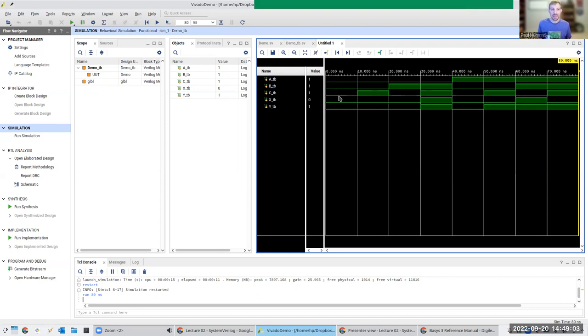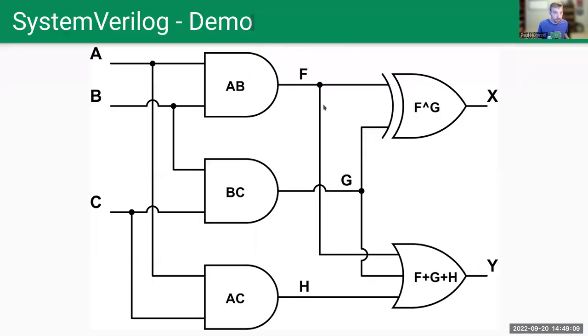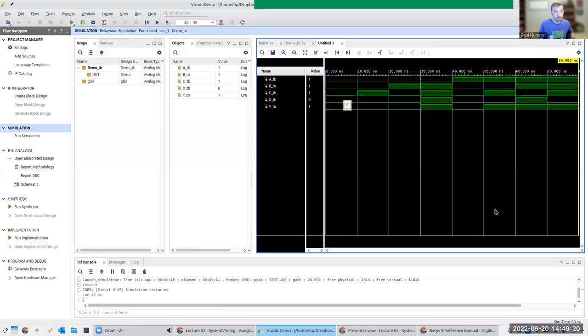And so if I'm anding all three of these, I'm looking at my F, G, and H signals, and these would all be zero in this case. And so zero's exclusive OR is zeros, zero's OR is zeros, right? So that makes sense. In this case, there's still only one input. So anding with zeros, no matter what, is still the same.